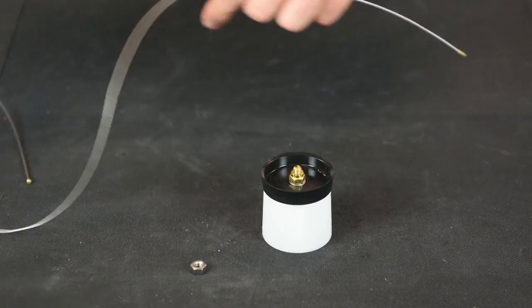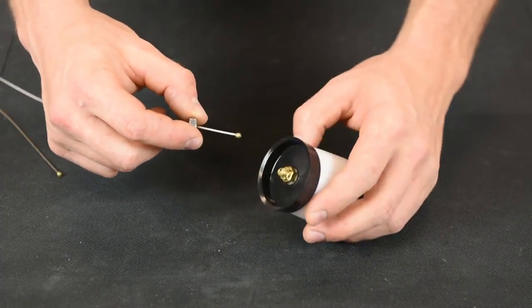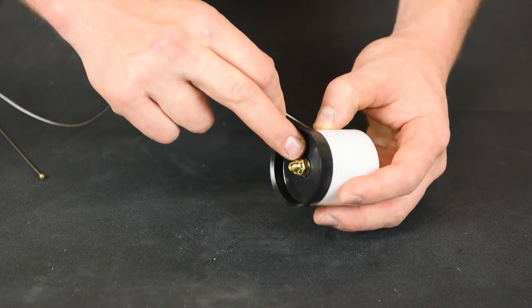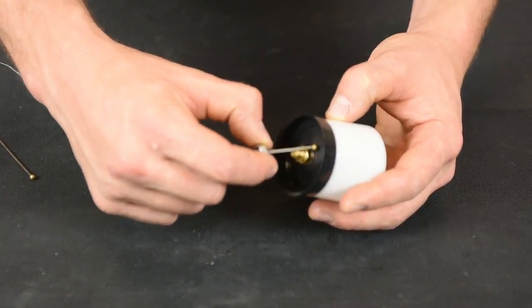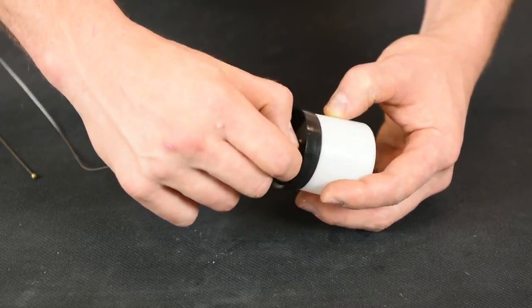Take your new cable, put it through the stainless steel nut, and then there's a slot. The brass nut's actually a castle nut, which has slots in it. There's a slot that matches up with the slot in the bolt. That's where you want the cable to rest. So you put the cable in there and then tighten down your steel nut.